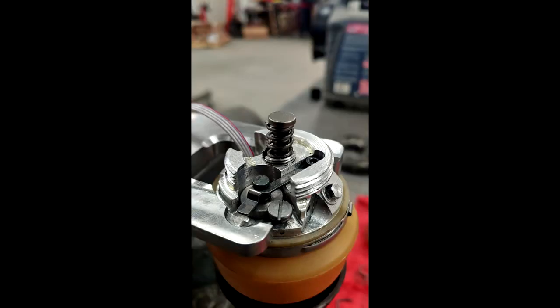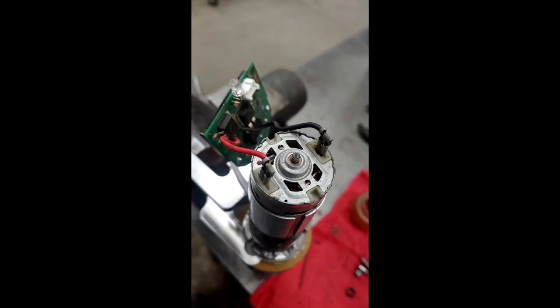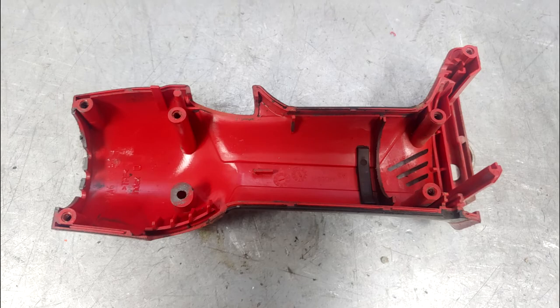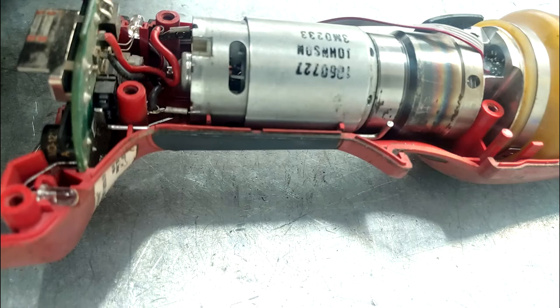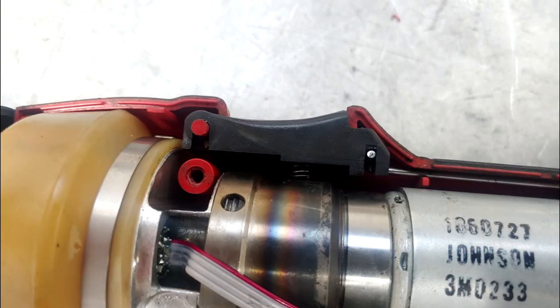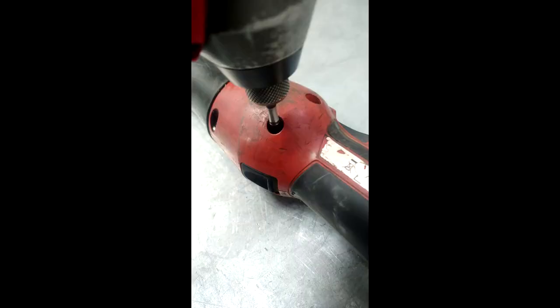Place in the spring and piston into the piston pump housing. Place the new gear motor on and screw it in, being careful not to cross-thread. Plug the control board back into the motor and pressure sensor — the motor will have a red dot by one of the terminals to indicate where the positive lead goes. Place the unit back into the case; it can only fit one way. Carefully slide in the control board and make sure the wires are clear from being pinched. Place in the relief button with the arrow facing downwards, place in the link so the flat side is against the small button on the control board, and put the spring into the trigger and place it on the plastic guide pin. Press the trigger towards the motor and slide it down on the guide pin making sure the link goes in the slot on the trigger. Carefully place the other half of the case on and screw in all screws. Note there is a small fine-thread screw that goes in a specific spot to hold the case to the pump body, and one screw of the same type on the other side of the unit.